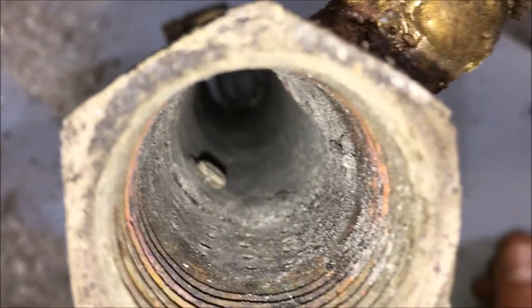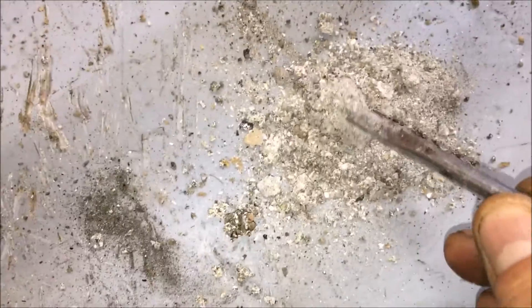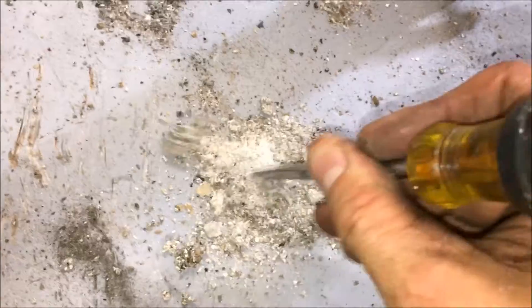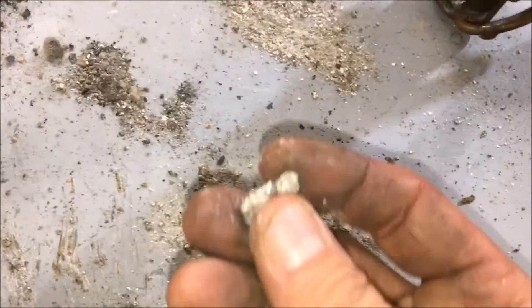Wow, that sucker's still hot. It may be my fault because I accidentally had this screw loose, which means a lot of air was getting in through that area. There's a very hard piece of vitrified ash. We were hitting some really high temps in there. This is completely vitrified — all ash. There was virtually no combustible material in the combustion column at all.